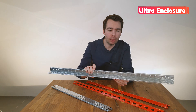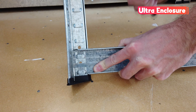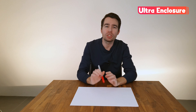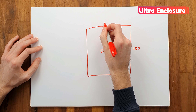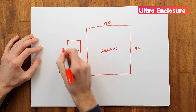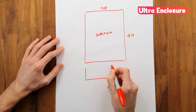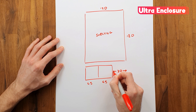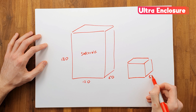The kit was designed and built with this excellent boltless shelving. It's strong, light, low cost, and very easy to work with. However this is a DIY kit, and there are other shelving systems which should work just as well. For this build I've selected a unit that's 180 centimetres tall, 120 centimetres wide, and 60 centimetres deep. If I draw this out and stack three printers on top of each other at 47 centimetres each, I still have 39 centimetres spare, which is plenty of room for the shelves and some spacing. Similarly with two printers side by side I need 90 centimetres and have 30 centimetres spare, so again plenty of wiggle room. Finally front to back I need 53 centimetres and have 60, which is the tightest dimension but should still work.